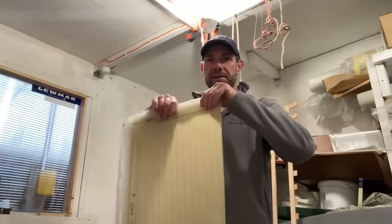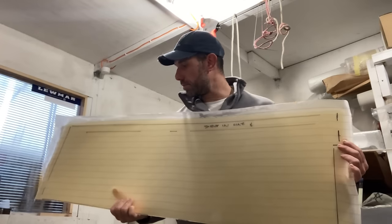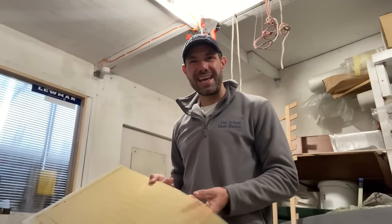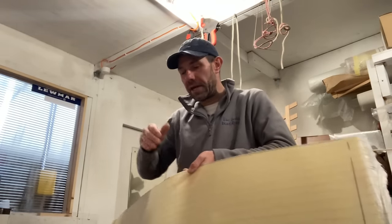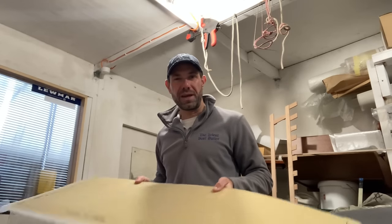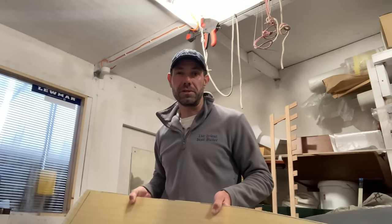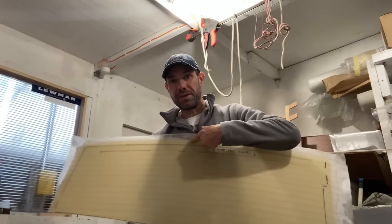Before I can take these off to the workshop, I need to start on the next one. I've got another flexy piece of glass and I'm going to do exactly the same thing again — cut up some strips of TMT and start gluing it down. I find the sweet spot is getting about three or possibly four strips of the wide planks down at any one go. Any more and I'm struggling to hold it all in position. Masking tape helps because you can stretch it and compress the pieces together. I'm using a fast hardener so I can glue them down and come back a couple of hours later to do the next strips.